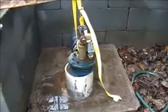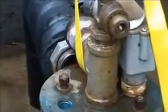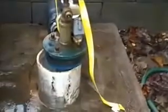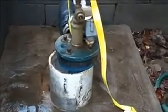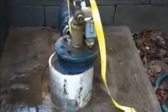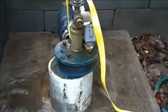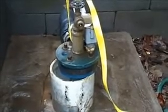Okay, here's the well seal pulled off. I was able to break the coupling loose. It was really tight. I had to use a little heat on it. See the map gas. The well seal is plastic top and bottom. I don't think I'll have any problem drilling it with a hole saw. I'm going to pull it up about another 3/4 inch and slide a piece of plywood in there underneath the threaded hole. And I'm going to take my hole saw down through there and get it ready to drop the 1 1/4 inch pipe.